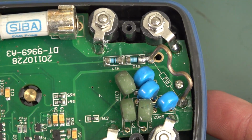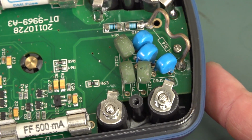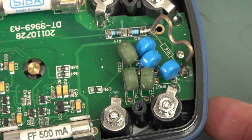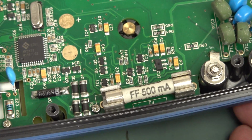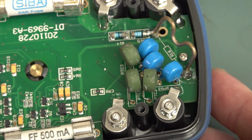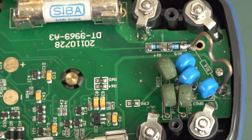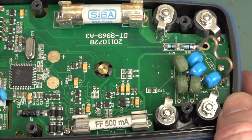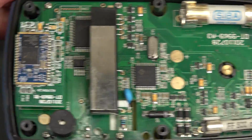Look at all the soldering there. But hey, it's got no shortage of protection. Look at this: 3 MOVs, 3 PTCs, plus your diode bridge and this other diode over here, whatever that's doing, but it's big and beefy. So, no worries. It may actually do okay on that front, but as I said, whether or not it meets the standard hasn't been independently tested, and Chem aren't really known for their highly rated meters.